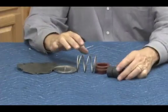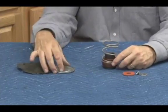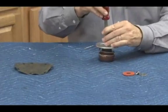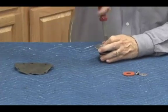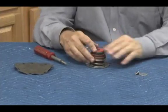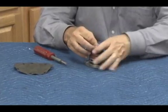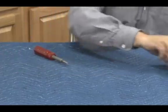So rebuilding it is going to be just the reverse. We're going to replace our O-ring and our spring retainer. Go ahead and tighten our spring retainer bolt back up. Have that ready to go, tight, like there. Relief valve disc retainer, relief valve screw. That's what my relief valve stem looks like. I showed you a 2-inch one just so you could see it a little easier.